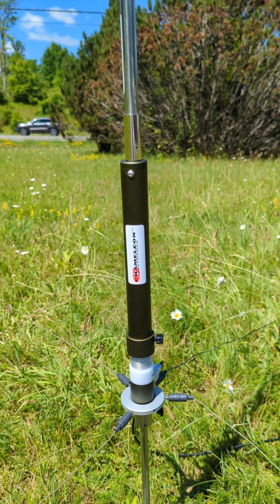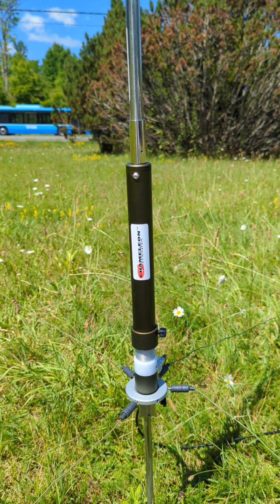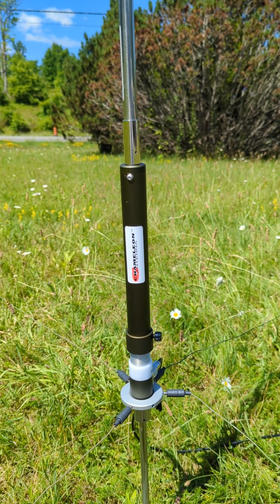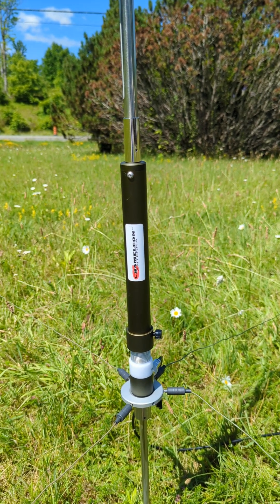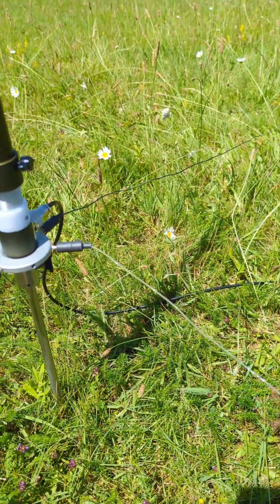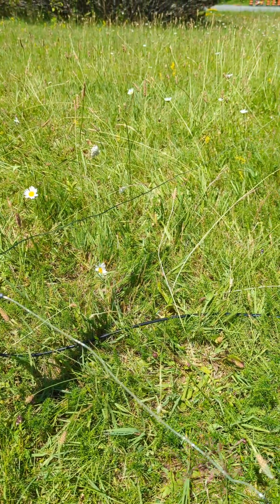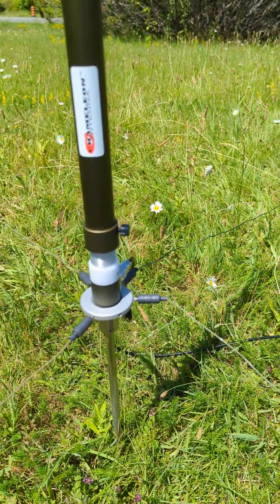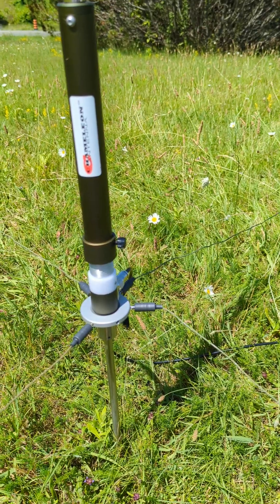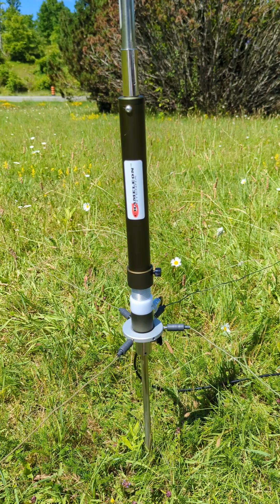That's kind of normal for these short antennas - they do require an LC circuit. In this case it's highly inductive with the coil and there's probably some capacitive effects. Anyway, it comes with four 12 and a half foot radials. The radial wire has gotten pretty thin lately - I think it's like number 20 gauge. I'm used to their number 16 gauge Kevlar-coated PTFE wire from some of the other Chameleon products that I own.